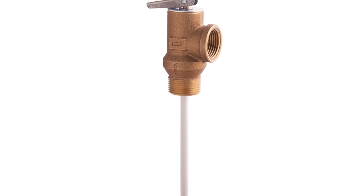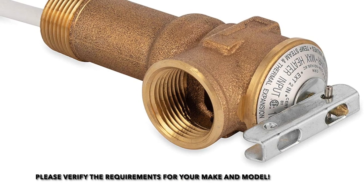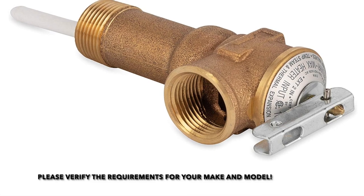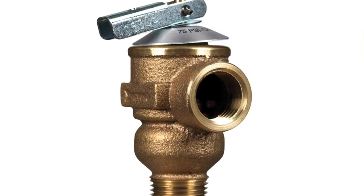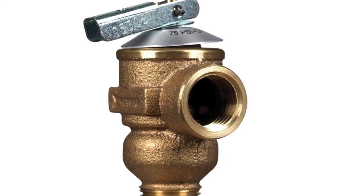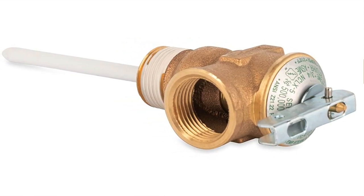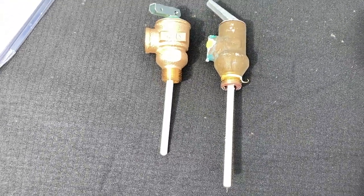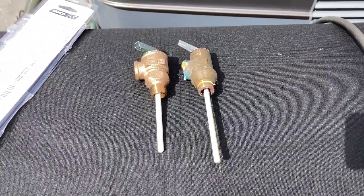It can be a little tricky shopping on Amazon. One looks pretty good — wrong, that's three-quarter inch, not going to fit. Another one may be half inch but it's too tall and won't allow the door to shut on the access panel. Another is short and half inch but doesn't have the probe that extends into the hot water tank — so all three of those are going to be immediate returns. One more looks good: stubby, long probe — but it's three-quarter inch, not going to fit. I'll put a link in the description to the one we ultimately arrived at. It's low profile, half inch, and has a long three to four inch probe that sticks into the water tank.